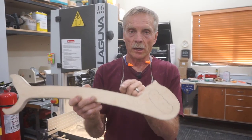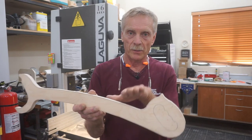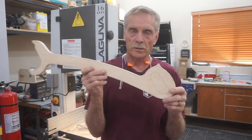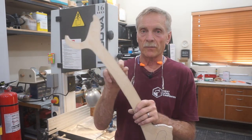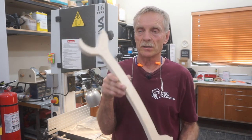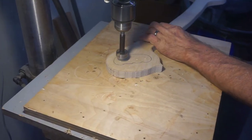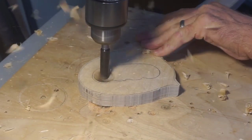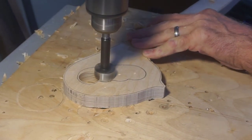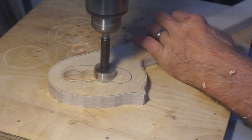And as I'm cutting, I just remember, as long as I don't go through the pencil mark, it's gonna be good. If I dip into that pencil mark, that spoils the final piece. So it's better off leaving just a little bit extra than taking too much, but 1/16 of an inch is a great margin for this process. Here I've switched to a 1⅛ inch drill bit using the same centers as the 1¼ inch drill bit holes, and that'll give me that routing margin between the piece and the template.